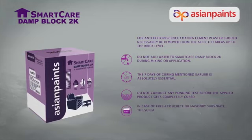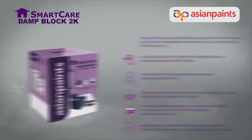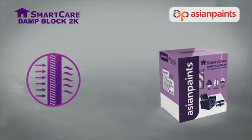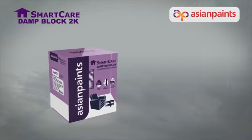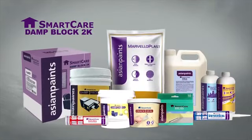In case of fresh concrete or masonry substrate, the surface must be cured for 28 days before application. Overlaying of cementitious screed or plaster must be done within 24 to 48 hours of application. Thus, with its superior positive and negative side waterproofing properties, SmartCare Damp Block 2K is yet another valuable addition to the ever-evolving Asian Paints SmartCare range.